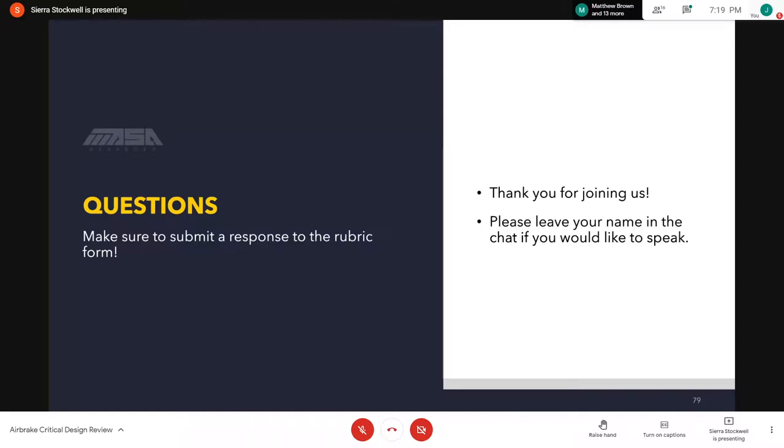R-A-N-S. Okay. Yeah, I couldn't tell you off the top of my head, but I think that is a multi-equation solver, so that's good. We've had convergence issues in the past, so we've run Spalart-Allmaras, the one-equation stuff, because it can be a bit more appropriate. Just as a note, I'm not as familiar with the solver, so you probably already did this research, but I would make sure your solver is appropriate for your particular CFD application, because it can really screw up your results if you have an inappropriately chosen solver.